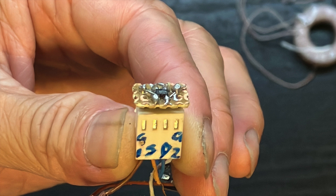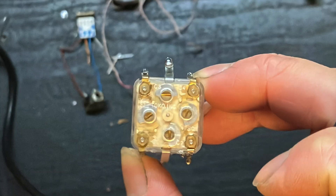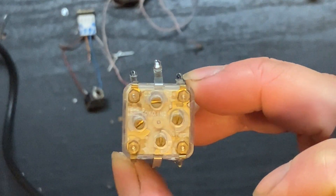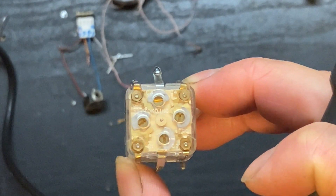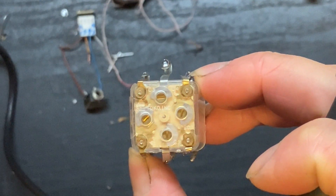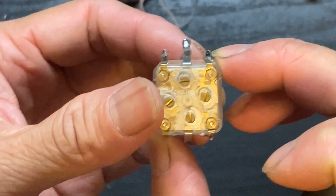On the left and the right you have the two gate pins, G1 and G2. In the middle you have the drain (D) and the source (S). These are all used in the circuit. For the variable capacitor, I'm using this special Japanese-made plastic variable capacitor. It has a very big range, 20 pF to 360 pF — that couldn't be found in other variable capacitors. But if you want to make it, you can still use the 270 pF conventional variable capacitor.